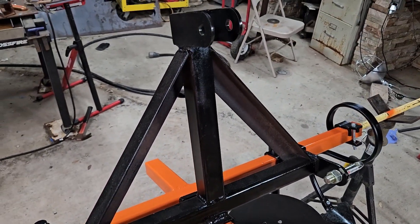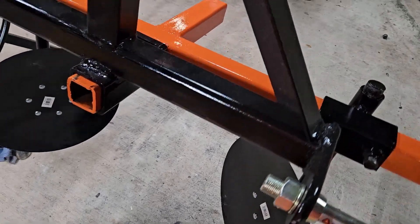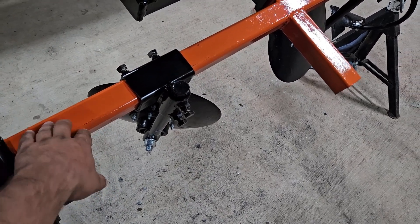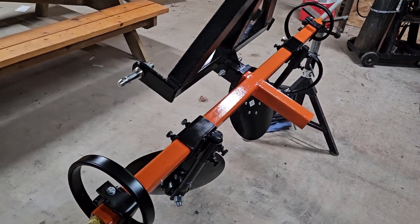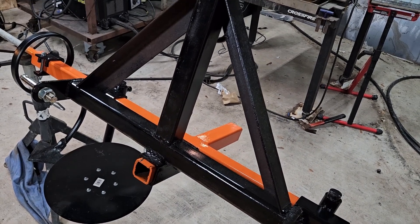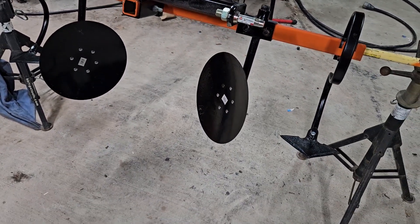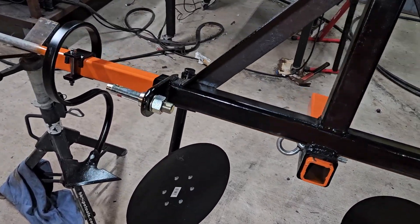These bolts were supposed to be 3/8 - I got the wrong size, but that'll work. These are all half inch bolts, probably about an inch in length. This was made on a previous video. I still gotta weld the two and five-sixteens ball in there, but I think this is gonna work nicely. This is some square 3/16ths tubing that I had - I wanted a quarter inch but that's what I had, so that's what I used. I still gotta do a lot of adjustments on here. If you're interested in this trailer hitch, you can find that on my previous video - I'll put a link above. Gotta weld the two and five-sixteens ball here for the gooseneck just so I can move it around and do some adjustments. This looks a lot better than what it did yesterday, so we'll get a shot in a few days. See you in the next video - bye bye.